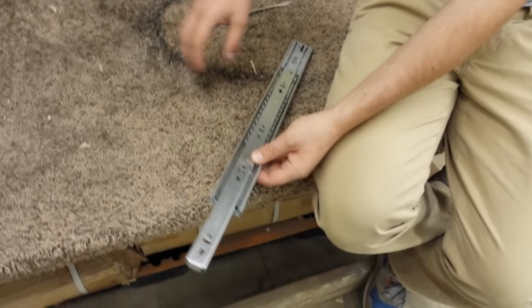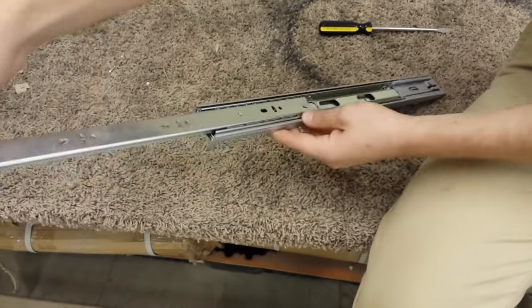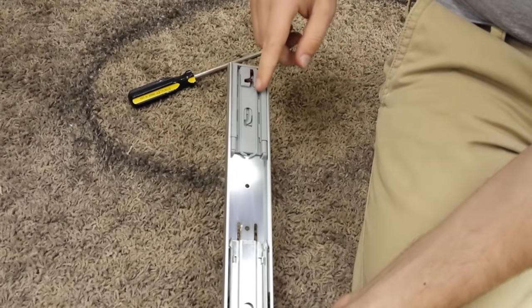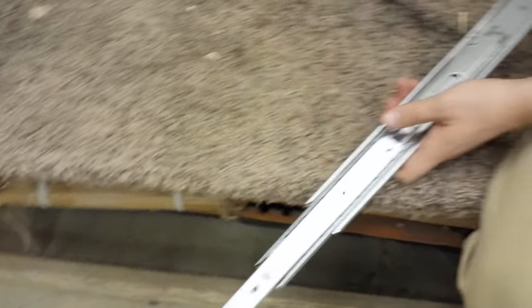Investigation to see what would make a soft close hinge not engage. You can see here's one that's not engaged. The reason is that this plastic piece needs to be brought forward for this component to engage onto it.